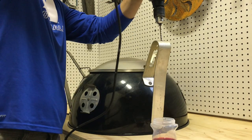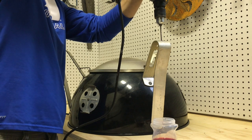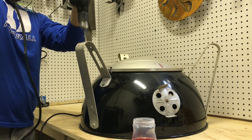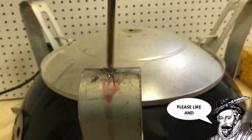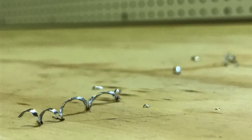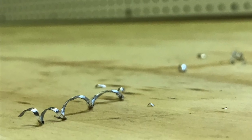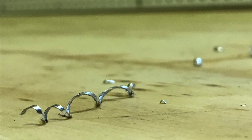You're going to need to step your way up to a 3/8-inch hole, so I recommend starting with a smaller bit and stepping your way up. Safety note: the shards that come off the legs when you drill into them are very sharp, so make sure you clean up and do this in an area where your kids and dog are not going to play.